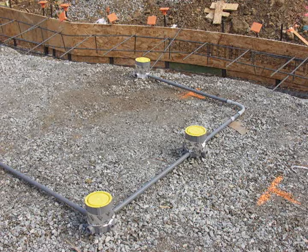The clients had requested floor plugs in the concrete slab, so we've gone ahead and laid our conduit and our three plug locations out on the floor and set up our boxes. The key with these boxes is to have them above the level of the slab — you do not want to finish them flush with the slab. If you finish them flush it's going to be difficult to get all of the equipment in there and set it up when it's all said and done. The electricians would actually prefer you leave it high — they can then come back with the Sawzall and cut it flush with the concrete. It's a little backwards from what might be intuitive, but that's the way the electricians ask for it.